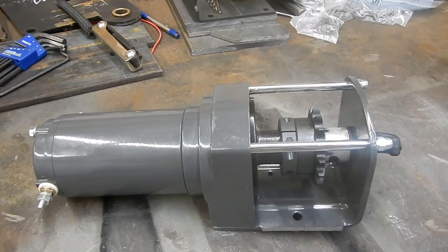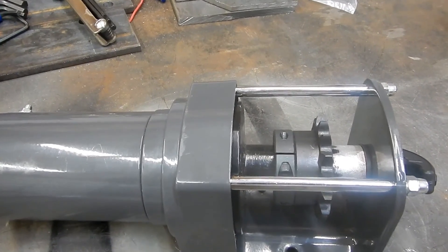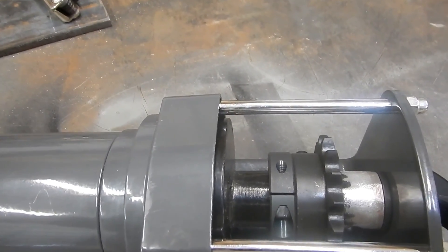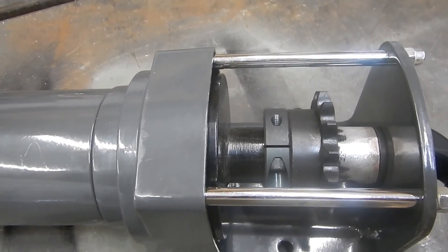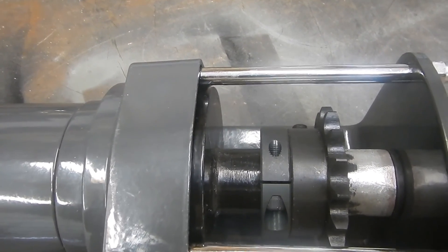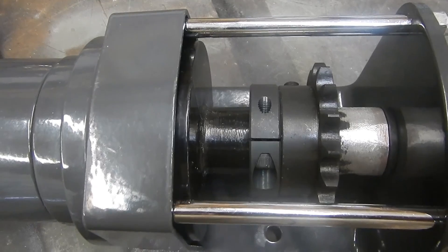You can see I've got the sprocket and the split collar in place. Neither one is secured to the spool quite yet because I've got to see where the sprocket placement needs to be. Ultimately, I'll drill into the spool where the set screws go so they anchor into it, then tighten the screws on either side of the split collar so it firmly attaches, and then put a small weld between the split collar and the sprocket.